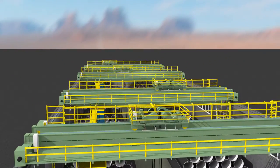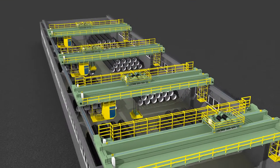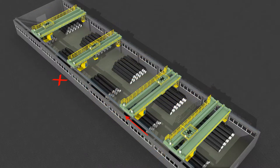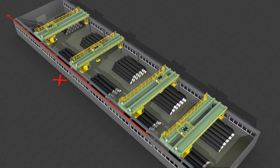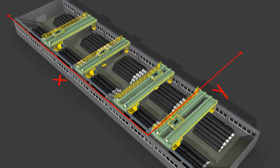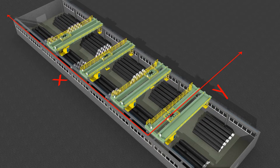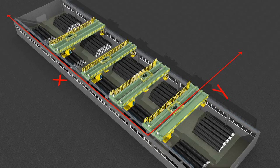Let's consider the use of the Magnetrack system for the traveling crane's positioning in the context of the most common mode of two-dimensional positioning. Let's determine axis X as the direction of the crane's movement along the shop span, and axis Y as the direction of the crane head's movement across the shop. Generally, a standard size of the positioning plane is several hundreds of meters by the X coordinate and several tens of meters by the Y coordinate.